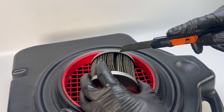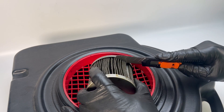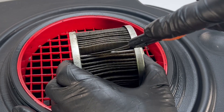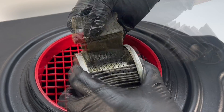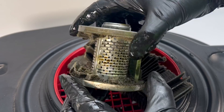The next step is removing the filter media from the core. What you need to do is locate this metal band that runs up and down across the core tube. From there, take something like a box cutter and cut around the circumference of the filter media on both sides. Then make a transverse cut along the metal binding strip and pull the first fold of media out. After that, it's just some elbow grease to remove all the filter elements from the core. There are a couple of ways to go through the media to inspect it for metal particles. The most common way is to take a magnet and go through each fold, running the magnet across each one to see if any metal particles get picked up.